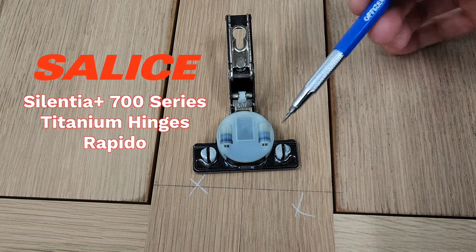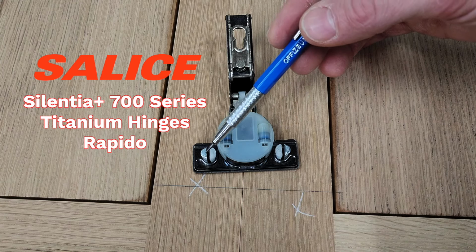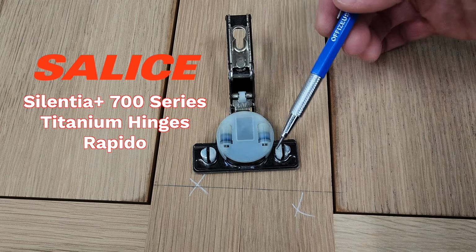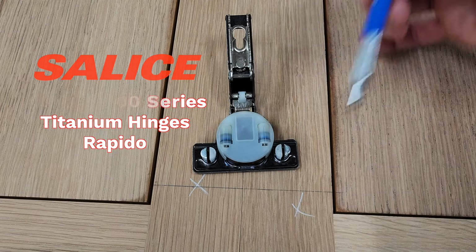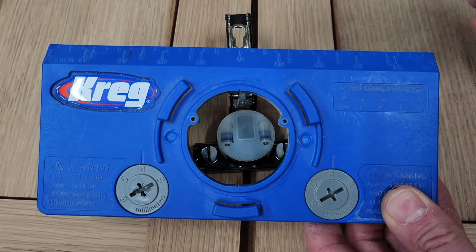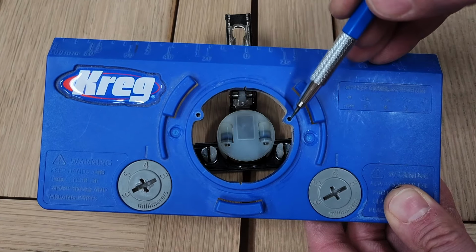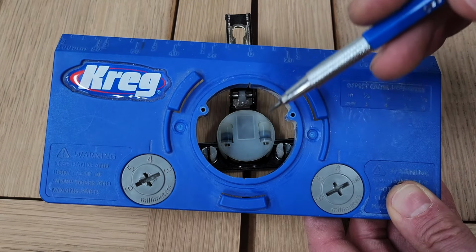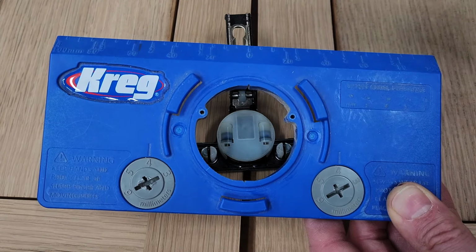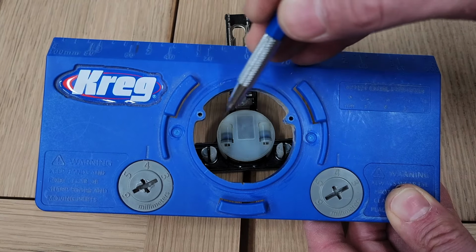Now, as with most cup hinges like this, the distance center to center on the mounting holes for these flanges, or screw holes if you're using screw-mounted ones, is 45 millimeters or 1 13/16. Typically I would use this Kreg jig for not only drilling out the 35 millimeter hole, but it also gives me perfect position for these outer two holes. But this thing can be a little bit sloppy and I really want these to be perfect. So I'm gonna do the 35 millimeter hole on the drill press,